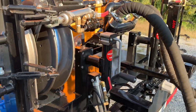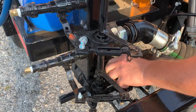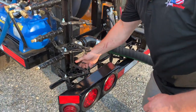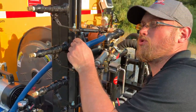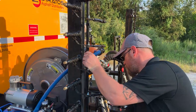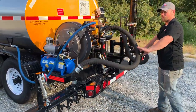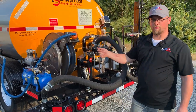Another nice feature is the pneumatically operated valves. When we fold these wings down you'll be able to see how they pin into each other, and we can control the zones that are operating at any given time. We're sectioned out into four-foot sections here, so we can make the whole spray bar spray at once or we can section it off into four-foot sections. The hoses are coming in from two sides of the spray bar now to get optimal pressure, and these are the air valves that are controlled by the air compressor and the press of a button.